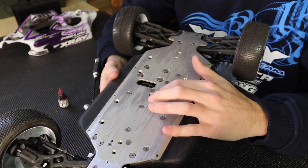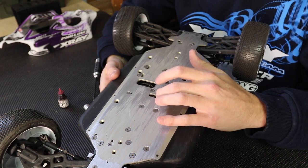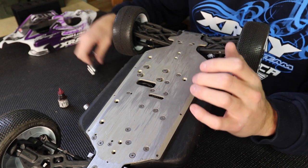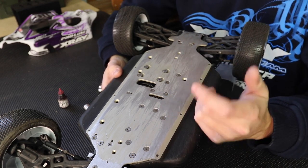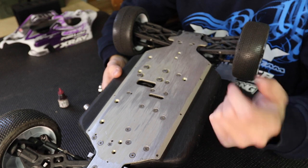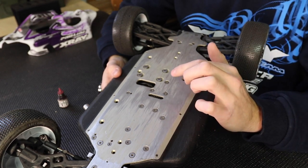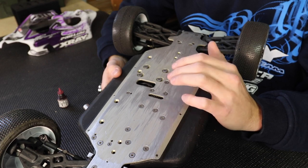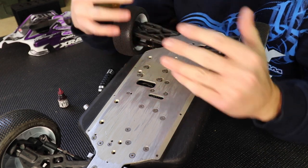I like to do the roll test to make sure it sounds right and nothing is misaligned or rubbing. What you're looking for is that little knock. You don't want too much of a knock and you don't want too little — it's hard to explain over video. You basically want your gears to be free without being so loose that it knocks the tips of the teeth off as you're running. You want a good mesh.